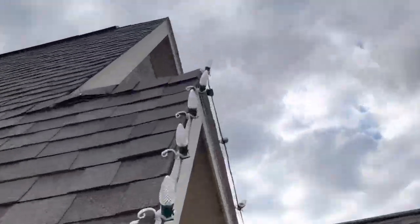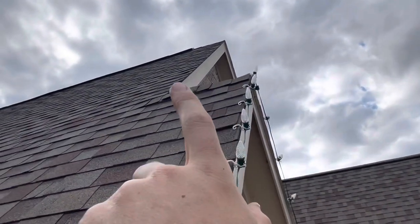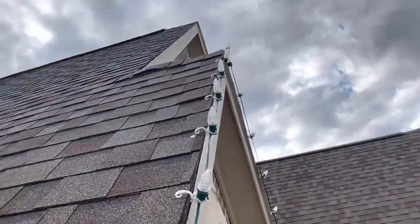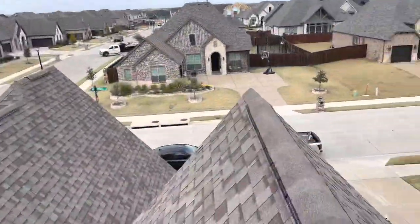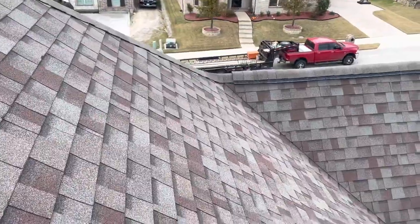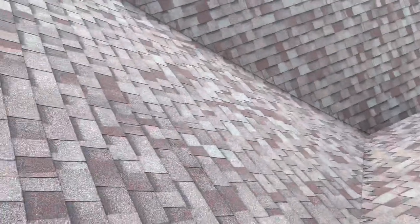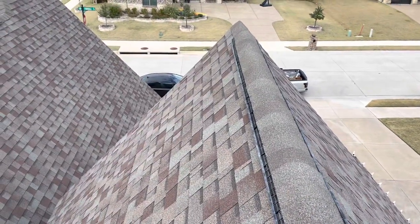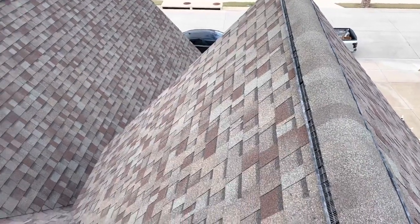I also put an inline right there — that inline is going to go from there to this peak. I'm about to hop up on the roof and show you me doing the peak. So I'm on the roof. This is a 10-12 pitch. It doesn't really look like it in the video, but that bitch goes almost straight up. If you download an app called Pitch Factor on your phone, it'll show you the pitch so before you get up, you'll know if you're comfortable to walk on it. I can walk 10-12s.